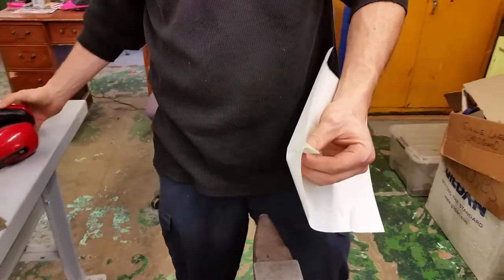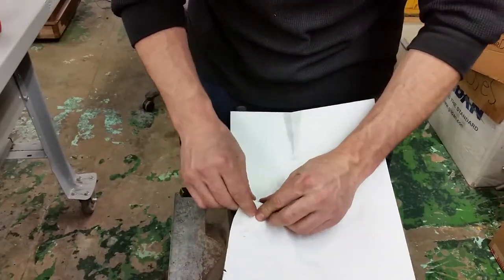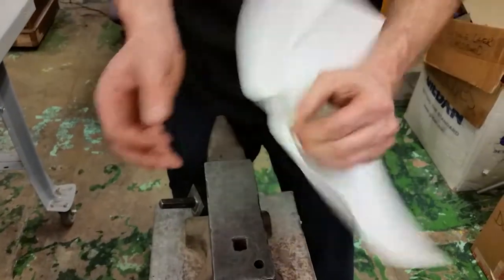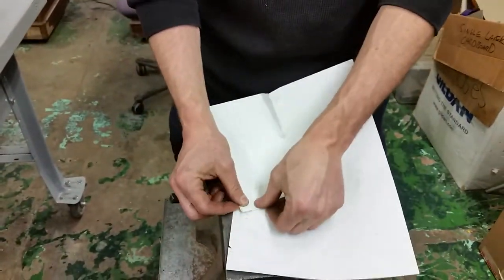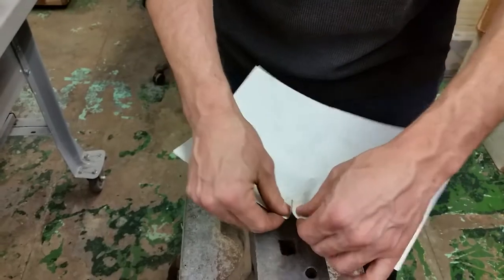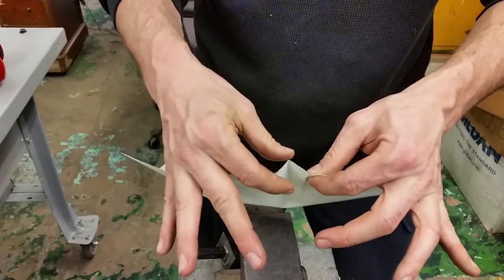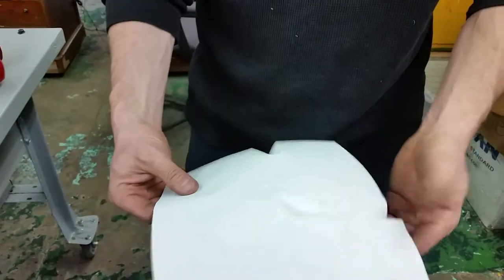So it's got these ears. Imagine if you were able to put a tuck in there — just like clothes — but keep it there and not fold it over. What I want to do is push it together and make it thicker with less distance. That's called shrinking.